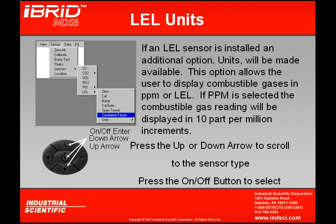The last option available on that drop-down is units, which applies to the LEL sensor and allows you to detect combustible gases in 10 parts-per-million increments. This is particularly useful for arson investigations looking for trace accelerants in a fire, where the combustible gas reading may not show up in LEL but may show up as a PPM if the concentration is very low. It's also useful for leak detection — for example, isolating a leak around a natural gas valve or flange — providing much greater resolution for the combustible sensor.